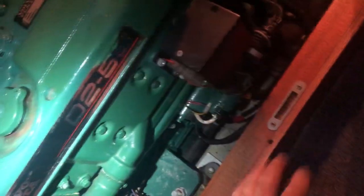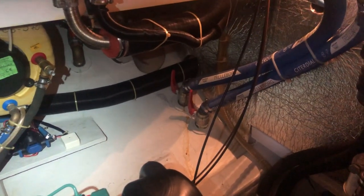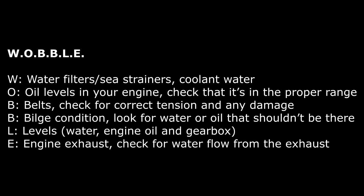If you've got sloppy oil in the bottom of your bilges, you can't see a new leak developing, so dry it out with kitchen roll. These are absolutely dry, lovely bilges. Have a look all around the bottom for any drips of oil, hydraulic fluid, or coolant — coolant is quite obvious to spot, usually pink or blue. Check for any water ingress. L is for Levels — a reminder to check levels. We've already done the oil level and the water level.